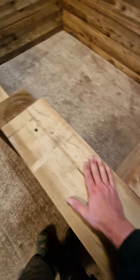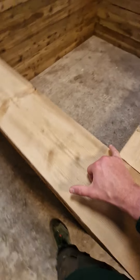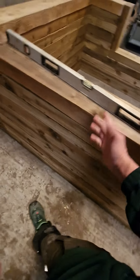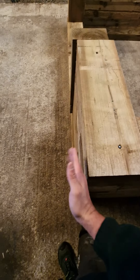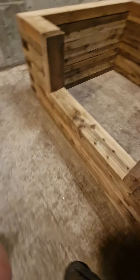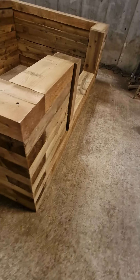You'll have about a centimetre or two where you can see the liner going over, so you stick your coping on and before you screw it down you can decide how you want it to look. We can do a thicker nine-inch coping if you want — that costs a bit more and isn't always available, but you can match it up to flush here, so it overlaps slightly and gives a 3D effect — just like the window does — making it look a bit nicer and adding more depth.